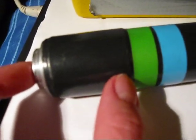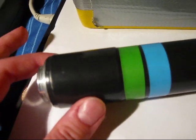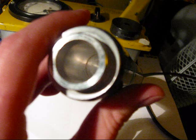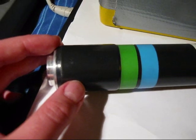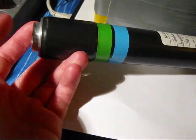The top of this device is a sodium iodide crystal doped with thallium. Little scintillations — flashes of light caused by ionizing radiation — will appear within this crystal, hence the name scintillation counter. The head of this probe has a hollow end so you can insert a probe into it, surrounded by the crystal. You cannot see the crystal because it's very sensitive to humidity — it will easily take up air humidity — so it must be well shielded, enclosed in an aluminum case like this.